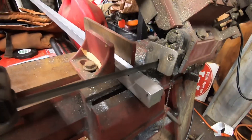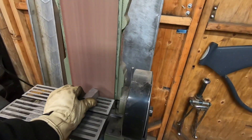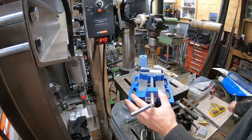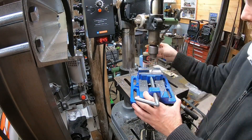Here I've got some 1-inch square stock aluminum for some hinges. It's probably overkill, but I want the hinges to be nice and solid — I don't want them flexing and bending around. I'm going to take them over to the drill press and drill some 1/4-inch holes through them so we can get some bolts through it and start welding this hinge together.